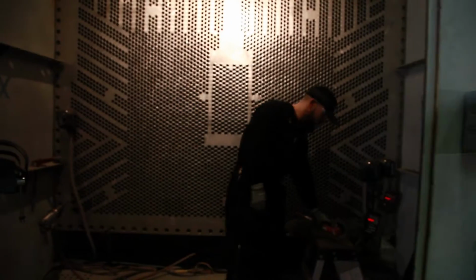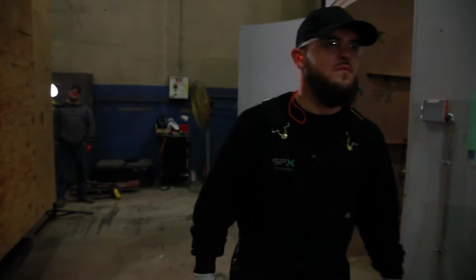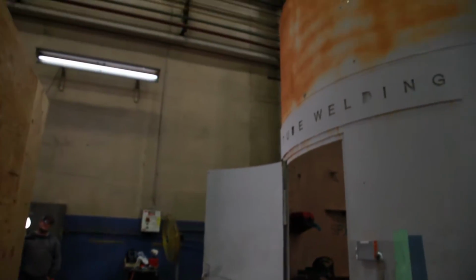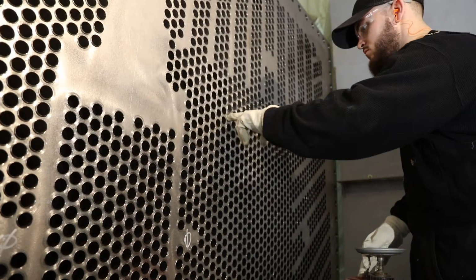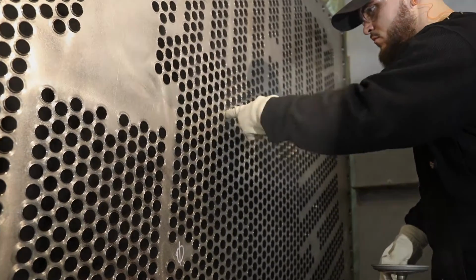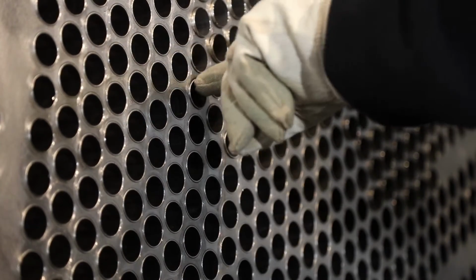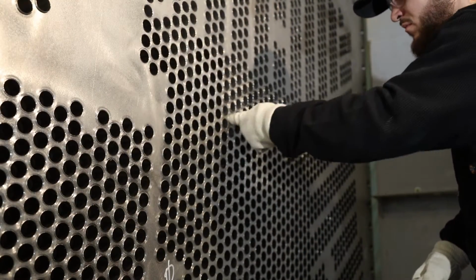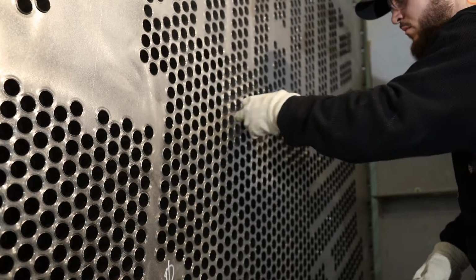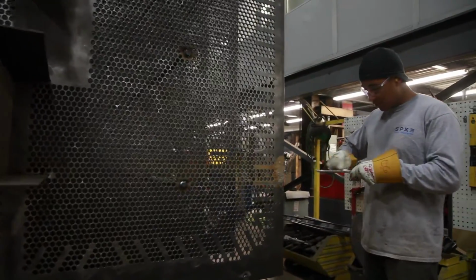The enclosure provides a clean, dry, safe environment for fusion welding and is designed to accommodate welders and equipment. Before welding begins, the tube sheet surface and tube openings are carefully cleaned with a lint-free soft cloth and an approved solvent, such as isopropyl, to remove dirt, dust, oil, grease, and moisture. Cleaning is performed within 1 hour of welding the individual tubes. The welder is responsible for ensuring the cleanliness of the work area and the tube-to-tube sheet joints.